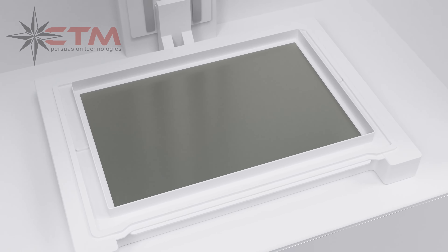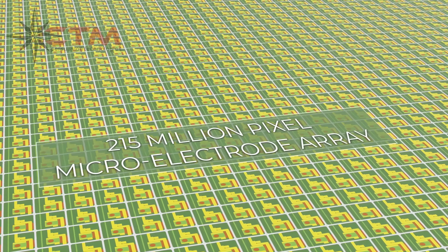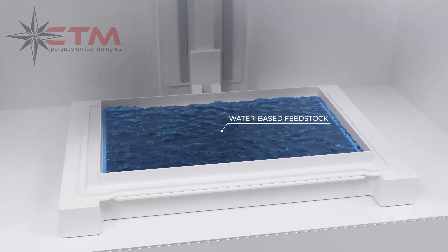They have a monochrome screen — no light source is needed. They do some secret sauce to the screen to make the pixels conductive, and they have a bath of copper solution constantly flowing through a vat so it's not creating pockets of air. They put the image on the screen, and those turned-on pixels become electrically conductive — let's say they're negative — and the fluid with the copper sulfate in it is positive, so it gets drawn to those pixels and you build up on that.